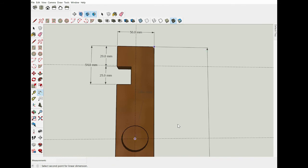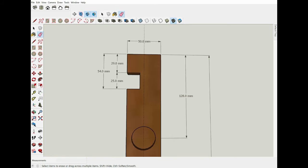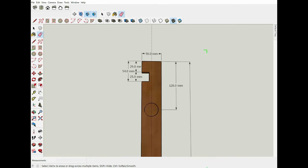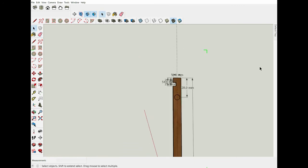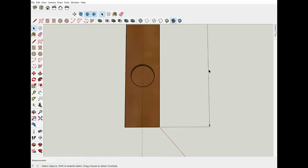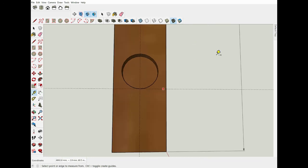Now those holes are going 10 millimeters deep approximately. I have the hinges being shipped in the mail, so I'm not actually going to drill those until I can get a test piece, check the drill depth that I need, and trial the hinge in a scrap piece before I put it into my final project. Once I've tested it, then I'll be comfortable to insert the hinge hole on this project.